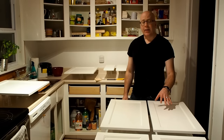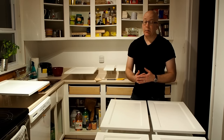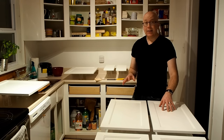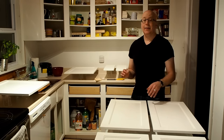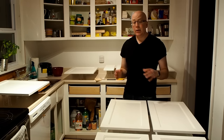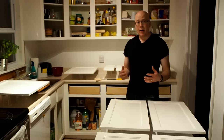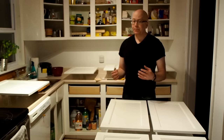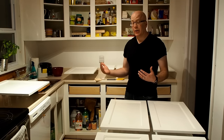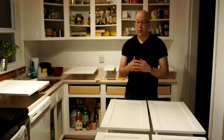The top coat is on, and I have to say it didn't go quite as well as we'd hoped. It is very prone to dust — it sticks in it and it's hard to remove. Obviously we're not working in a perfect environment here; we're doing it in the kitchen. Also, it changed the color slightly — there's a slight yellow tint to the finish now that we have the protective top coat on there. Both of these issues wouldn't have been apparent had we had the decorative glaze on, or maybe a different color. But just be aware, if you're working with pure white, you may run into these problems yourself. We still recommend the product — we just feel like our results here took a step backwards with the addition of the protective coat. That said, it's much, much better than what we started with, and overall we're happy with it.